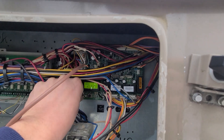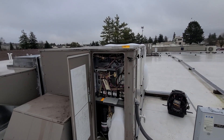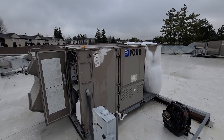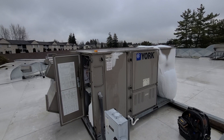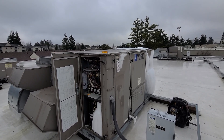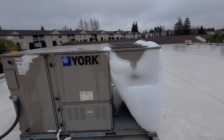And 63.3. I don't know what other damage this has done, but since it still has backup heat I'm basically going to make it so the compressor stops running and doesn't create even more ice. If you liked the video, give it a thumbs up and please subscribe. Feel free to comment if you've run into similar things on these Yorks — we've seen it quite a bit. The company I work for used to install these Yorks but we don't anymore. I need to check how far back we did prior repairs on this unit, since some of this work might end up being warranty. Thanks for watching.